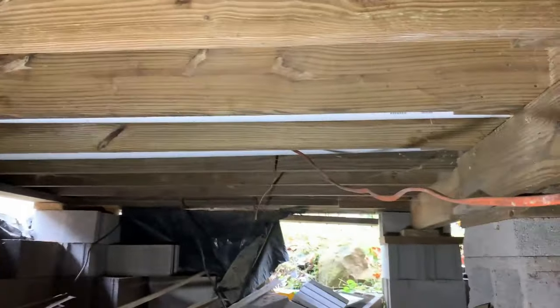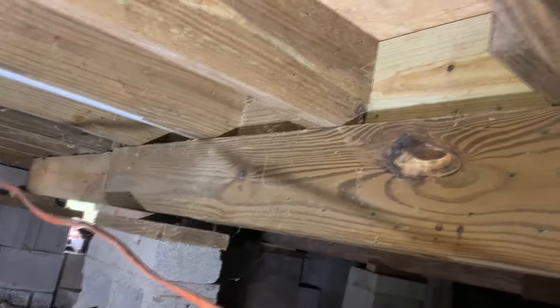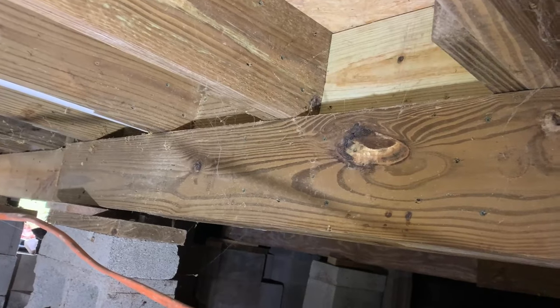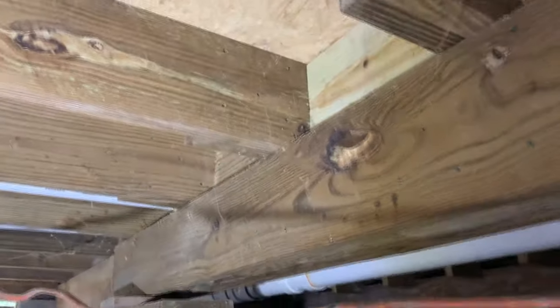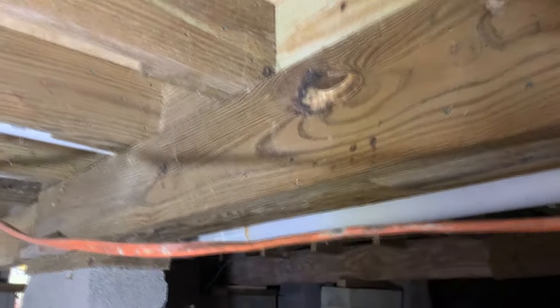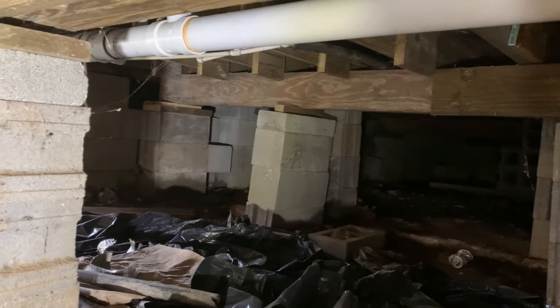This room was actually 10 feet long. What we've done is put in a new girder beam over here — that's at about seven and a half feet in from the outside wall. Above it we've got joist blocking to keep the joists from twisting and turning. We used Advantec flooring on it — that stuff's wonderful — and then of course on top of it we've got our finished flooring in the bathroom.